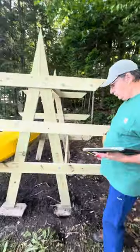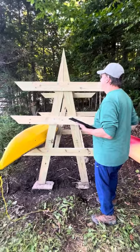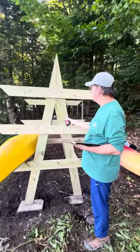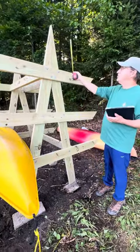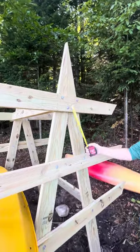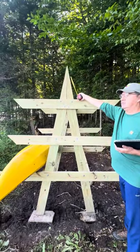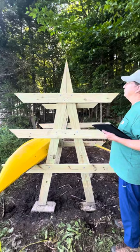We're going to take our first two eight-foot two-by-sixes and cut the angle. First, we're going to draw a line about 26 inches down from the top, and then at that point draw a line that goes from the top corner to the opposite side, giving us an angle of about 11 degrees — but that doesn't matter as long as you cut them all the same. Cut these first four boards with that angle, then put them together gently with two-and-a-half inch deck screws right at the top, make them match, and get your deck screws in.